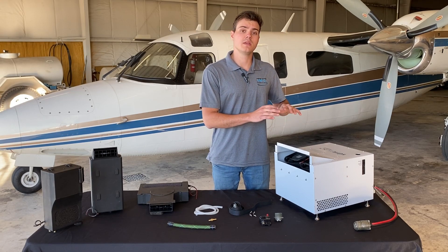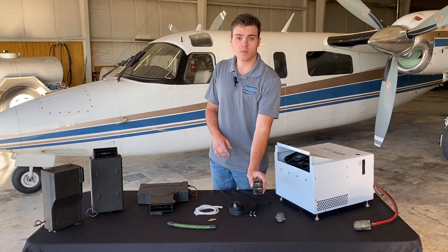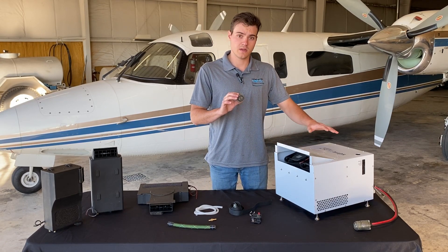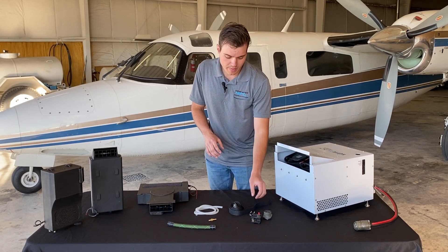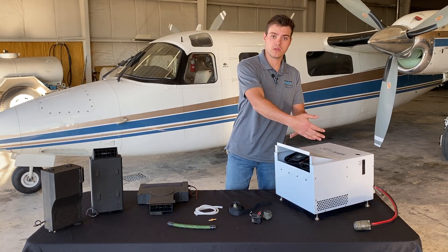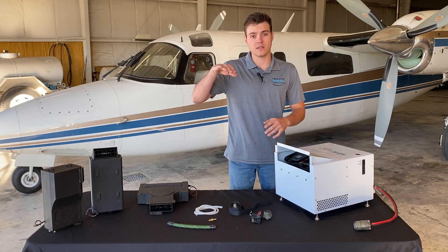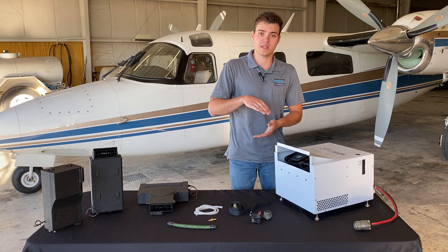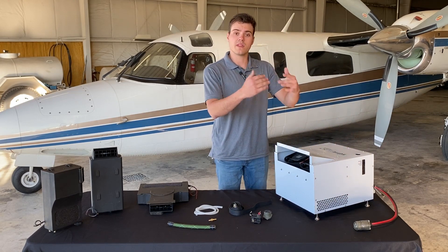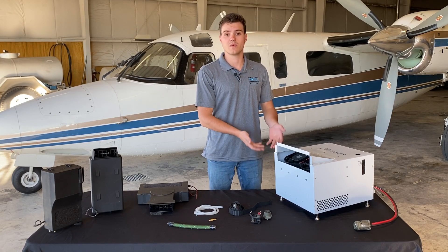As far as wiring goes, we typically connect this to either the alternator or the main bus of the aircraft. We then run the wire back, and we provide a circuit breaker that is typically mounted near the pilot. Moving on back to the baggage area, we have a plug that is mounted near the pack. For securing the pack, we provide tie-down connections and baggage straps — we typically just throw a strap over the unit so it can still be easily removed, but it is secured. On the unit itself, we have adjustable feet in case the height needs to be adjusted or the baggage floor is not completely level. We have an intake vent on each side and underneath, in case bags get set on either side of the unit, making sure we still have sufficient airflow.